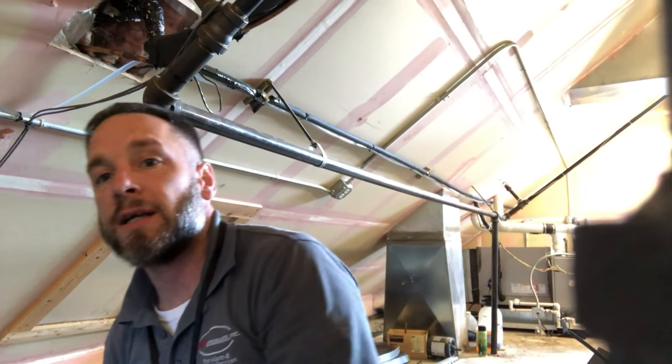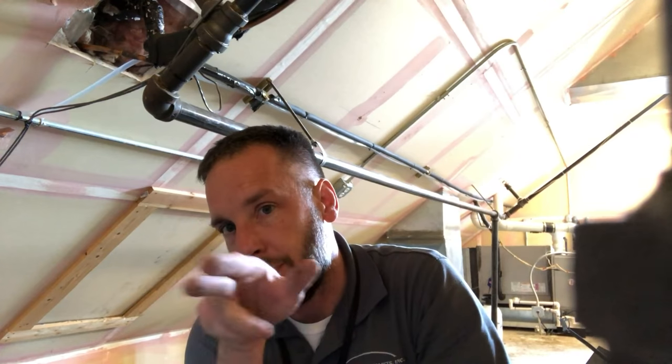She's all the way through, so that's about the long and short of it. For a harder piece of metal, you want to wait until you see it start to drill in before you start to apply too much pressure, otherwise that screw is going to start to run on you and scratch the surface. Sometimes on bigger metals, if you can just take something and pop it — like a nail or an awl — it gives you a little starting place. If you've got any questions or want to see anything else, let me know.